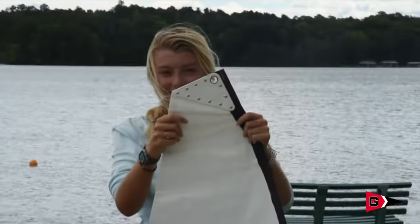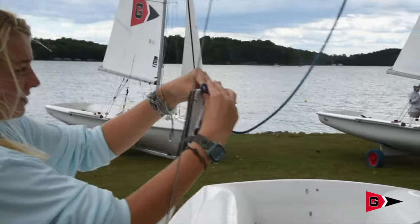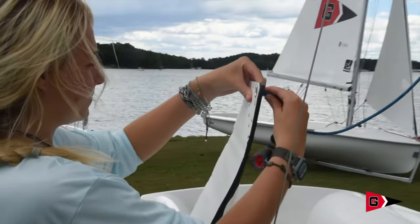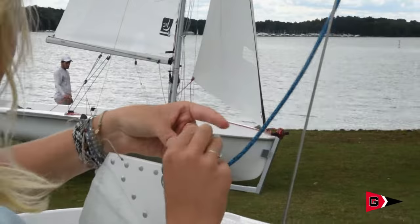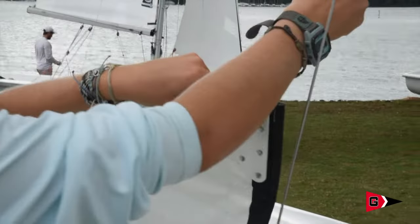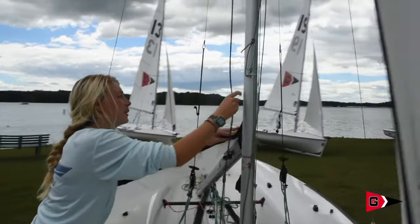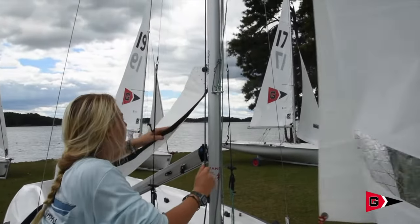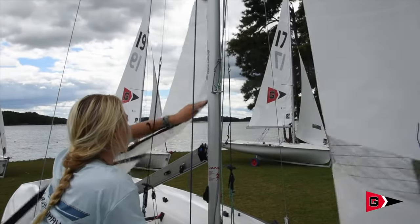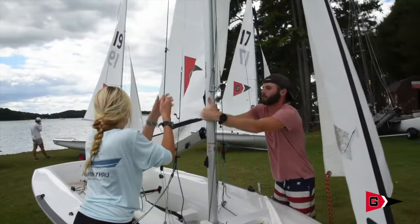Next, find your mainsail and locate the head. Go back to the halyard that you previously tied off for safety, make a loop in the line, feed it through the eyelet, and put the plastic ball through the loop on the other side. Pull taut and remove excess line. The jib has a wire along its luff, and the main has a line sewed inside its luff. Feed this reinforced part of the mainsail into the entryway for the track on the mast, and pull the halyard to raise the sail. Grab a friend to help the sail enter the mast smoothly and efficiently.